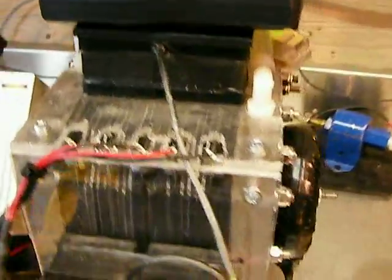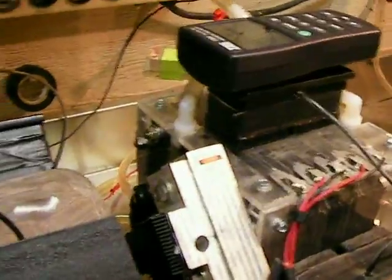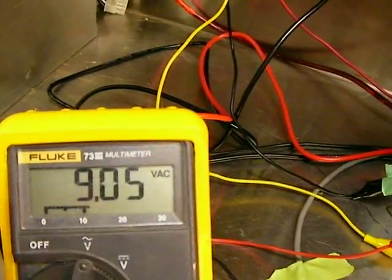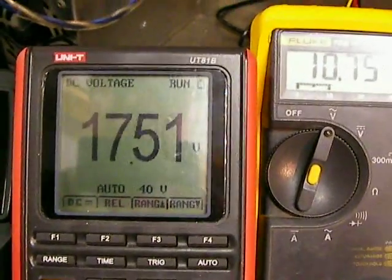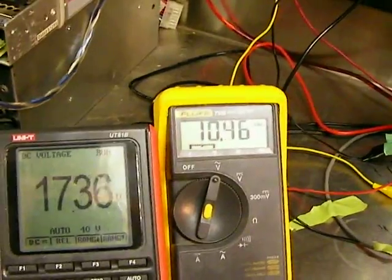I've got a dry cell with a unified field coupling going to the middle, and a water treatment system. What I'm putting into the hydrogen cell is frequencies from an amplifier — I'm actually making hydrogen with an amplifier, turned down real low. The voltage in is about 9 to 10 volts AC, and the voltage out going into the cell is 17 to 18 volts DC. I'm actually getting a voltage increase, but the amps drop, which makes sense.